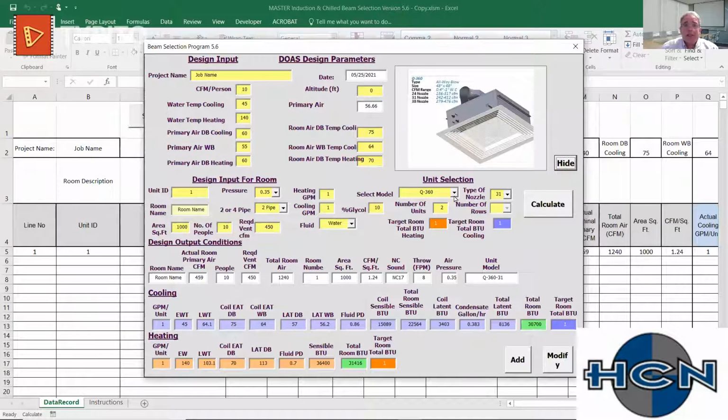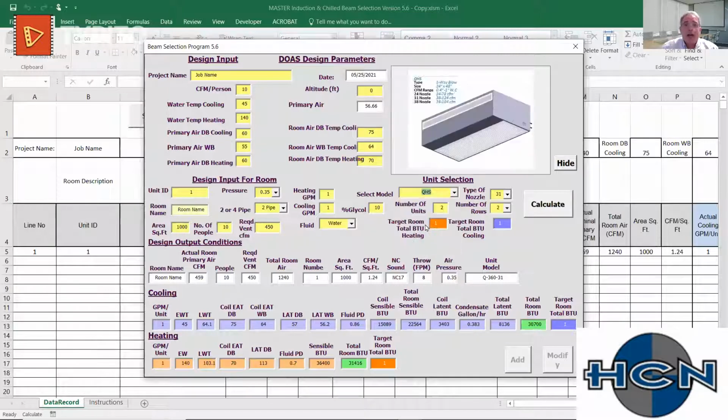So that is an all-way blow unit. We have Soffit units. This is a very, very popular unit now. Again, it has enormous capacity from very low. So at 0.2 inches of static with the smallest nozzles and only 1 row of them, as low as 38 CFM in that space with about a 4.5 to 1 induction rate. Or we go to our biggest nozzle with 2 rows, and again, at an inch of static, it goes from 38 to 368 CFM of outside air. So enormous capacity.